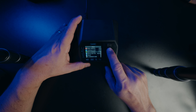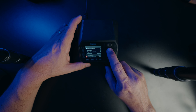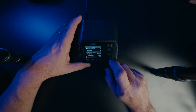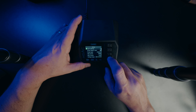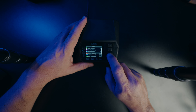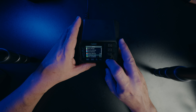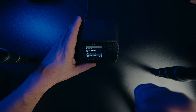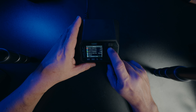You can come down here to personalization — theme: light or dark. You can change your backlight, change your volume. I've turned it all the way down because I'm just not a fan of all the beeps. There's security, all your temperature settings, input settings, whether it's AC or DC. I like to limit on DC to the minimum voltage so I don't over-discharge a battery plugged into the back. You can turn battery selection on or off — if it's off, I think it's probably gonna lock you into a LiPo. Continuous work mode means as you plug a battery in it'll just charge it on the last setting, which is a really handy feature if you're going battery to battery to battery.